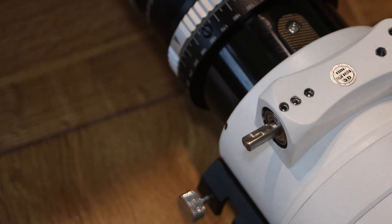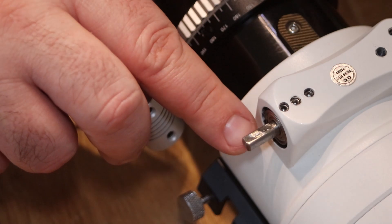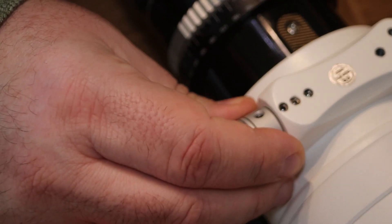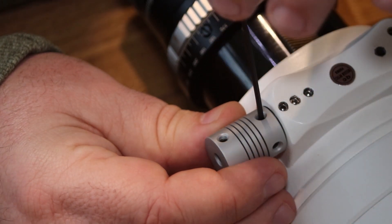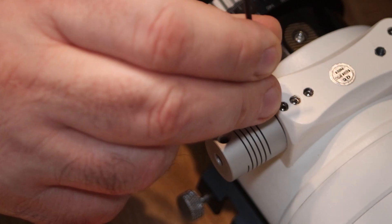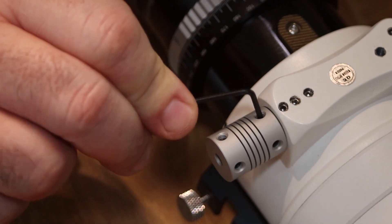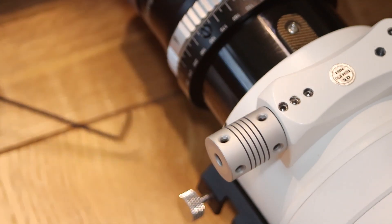So the next thing I'm going to do is offer this flexible coupling up. Make sure it's in the right orientation — there's a flat there. I'll line up the grub screw, push it all the way in, and back it off a little bit just so there's a bit of a gap to avoid any binding. Right, so that's on the flat. I'm going to turn that around — there's another one there. Do that up as well, just a little nip. And a nip on there as well. That's all it takes — it's a tiny little bit. Make sure it's secure, which it is.